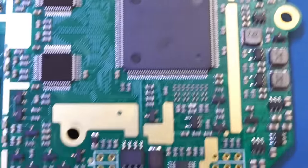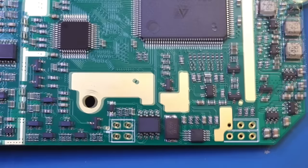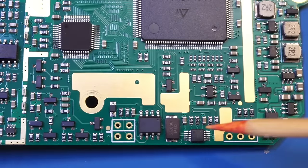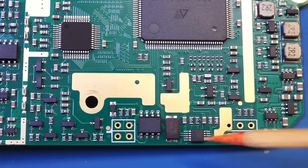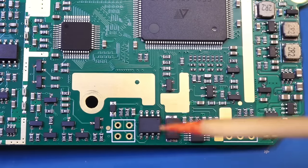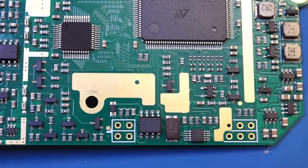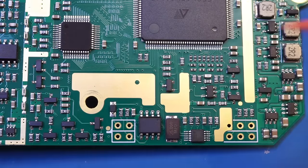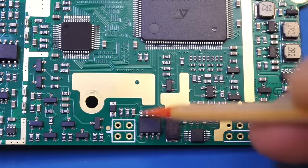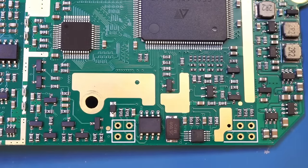And let me move it down further. And by the look of it, here in this section, we have a MS5351. That's a tiny chip there. That's a clock generator. And I'm not sure what this 8-pin chip is, as it doesn't have any markings on top. It could be a differential amplifier. As you can see, we do have a couple of these very thin traces that go in the general area of that chip. And that's all the circuitry in this oscilloscope.